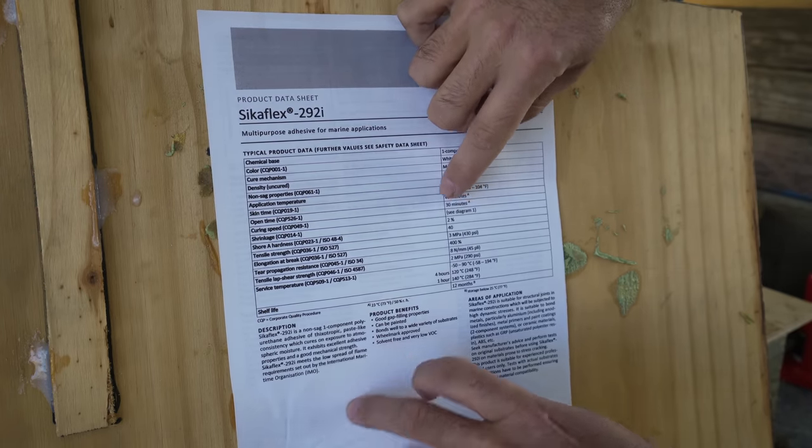With Julian on the outside of the keel and me on the inside of the keel, it took us about 8 minutes to apply the adhesive before we were ready to lift the keel up into place. Lifting the keel went 100% according to plan and just like our last few practice lifts, complete with needing to do a quick fore and aft adjustment along with the hull to keel angle adjustment.